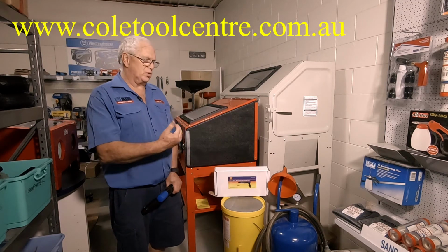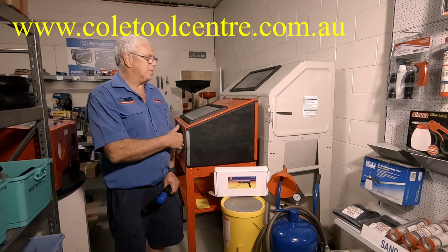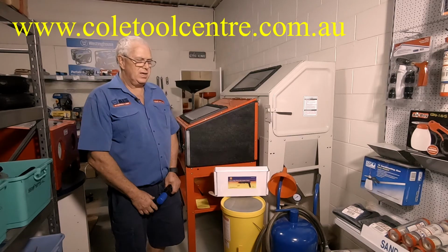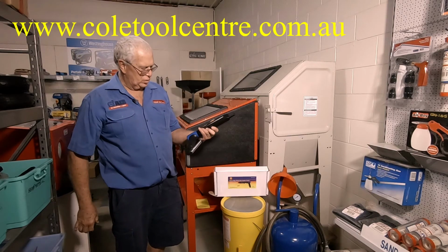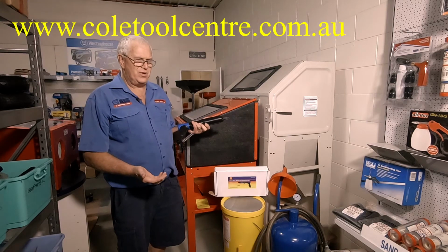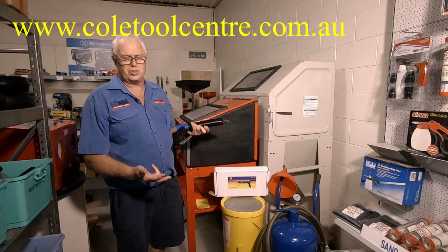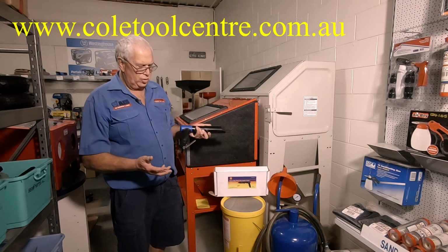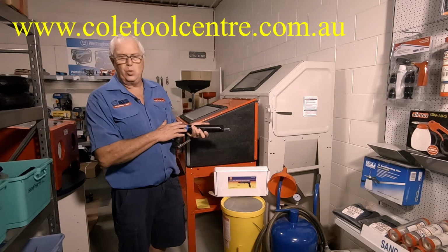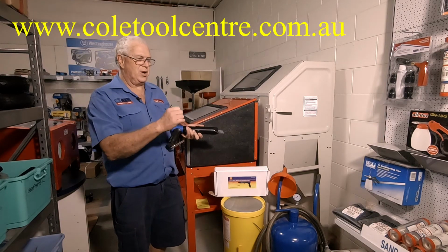Because most of the time you're trying to remove rust, scale or paint with sandblasting, another option, if you don't have enough air, is to look at one of these. This is a needle scaler. It doesn't use anywhere near as much air. It works very efficiently on the removal of paint, rust, scale and flaking rust. And you can use it with something like even any of your belt drive compressors. That would be great for getting a lot of your loose scale and rust off.